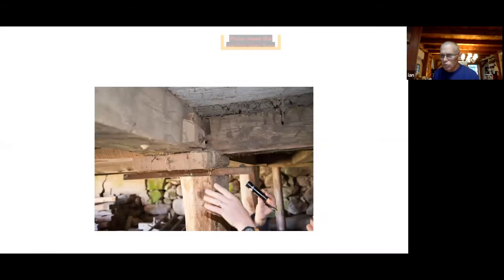Here's another example of a tenon popping out. You can see whitewash up there — you know cows were up there. That's an instance where you really have to look above before you try to move things around. You never pick up a barn with just a post and a jack — to be safe you have to build cribbing towers. A cribbing tower is built with six-by-eight timbers in a lego-like system, building a four-sided box that's roughly four-by-four by the time you get up there, with the jack at the top, so you're protected and don't have to worry about kickout.